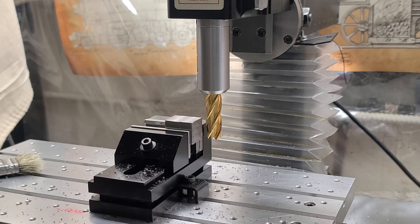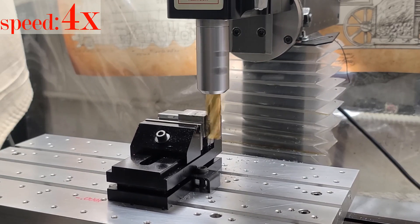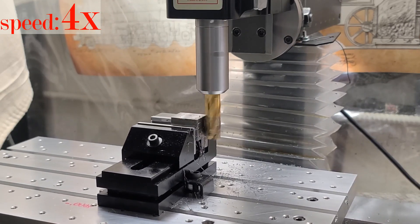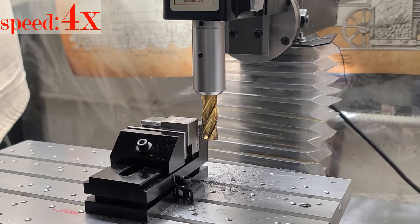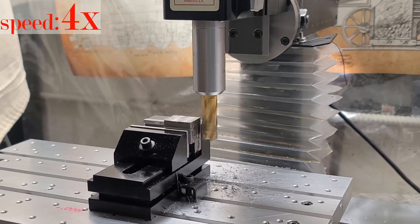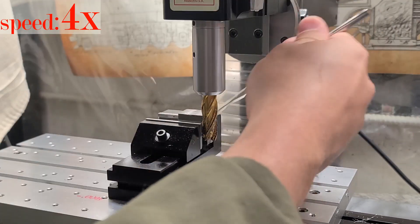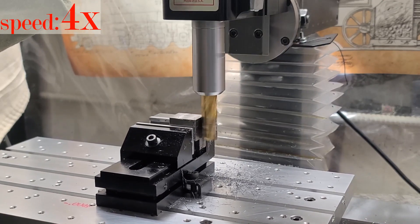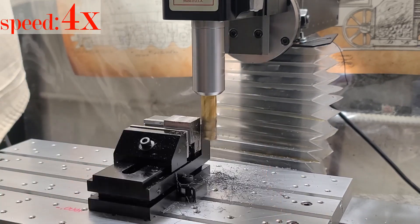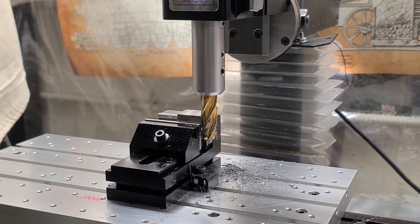Let's see what the journeyman trick of the day actually looks like. I've already set my distances using the journeyman paper trick. For this first cut I'm really only going to be removing probably around three to four thou, and I'm going to begin by taking a conventional cut. It's running really nice and smooth, but there's a horrible noise — I've got something wrong with my speeds and feeds. It's looking really good and if you pay attention to the headstock there's no bounce. For my return cut I'm going to be taking a climbing cut because I'm only really doing a finishing or pressure cut. I've gone in and taken another five thou off and played a little with the speed to try to get a better handle on that wailing noise. I've really cranked up the speed and you can see those chips are just flying off — very uniform size chip, fiendishly sharp and horrible to touch, which is why I make sure I wear my safety glasses.